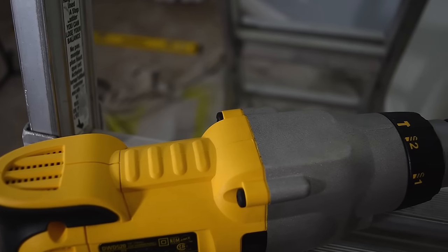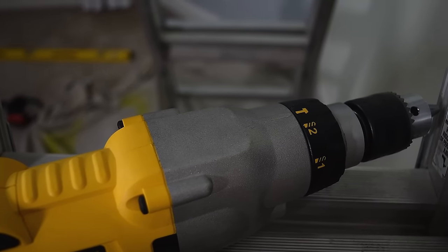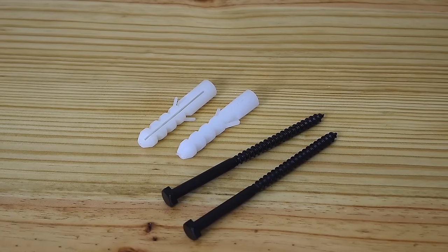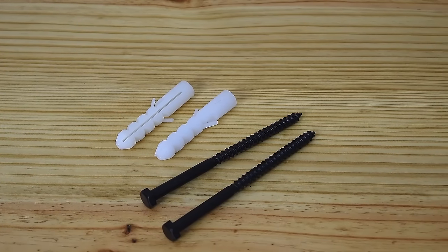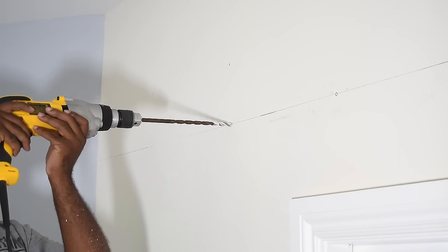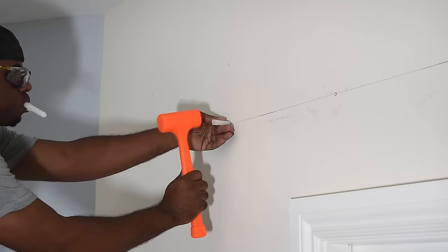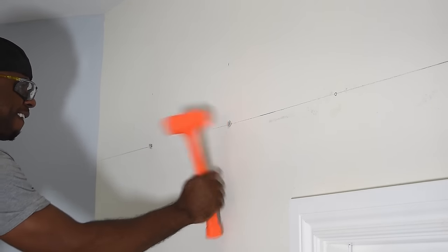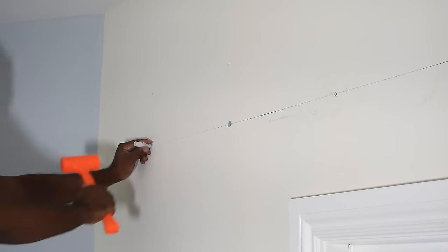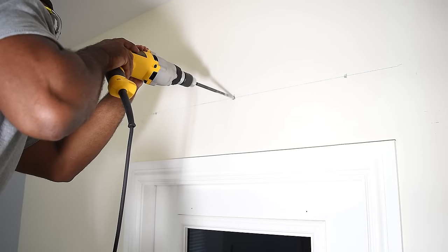This is not a typical installation — I'm using a hammer drill because I'm drilling into a concrete block. The screws that come with the barn door hardware are only for wood, so I'm still planning to use the screws but I'm also using some large wall anchors. I've used these particular anchors before — they used to come with large plasma TV brackets. Once you run a screw inside them they open up and there's no pulling them out of the wall.